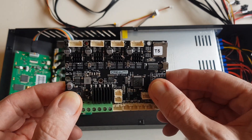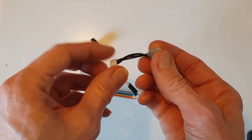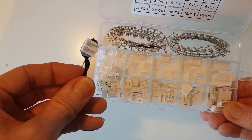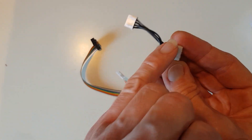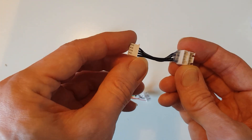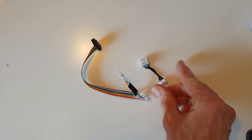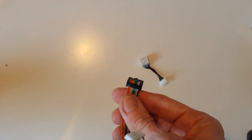In the end I needed to create two connectors for the new main board. The first one is the dual Z, and I've got a bunch of JST connectors already so I ended up taking two and sticking them together, soldering some wires on, using a bit of hot glue to protect and hold the wires in place, then putting a plug on the end. You can buy these but given I had the connectors it was just easier to fabricate this.